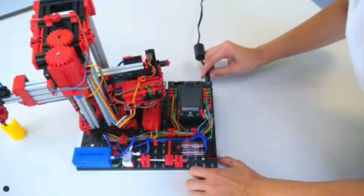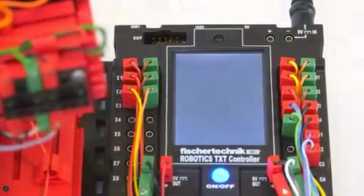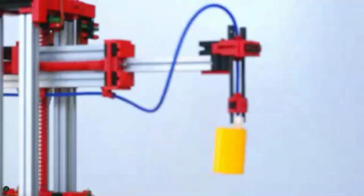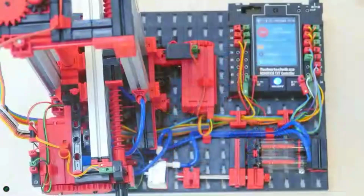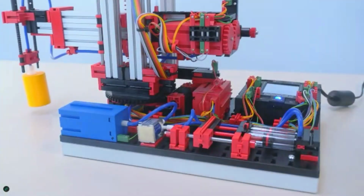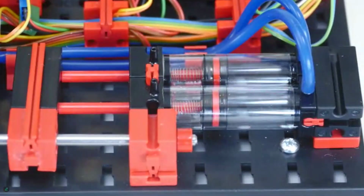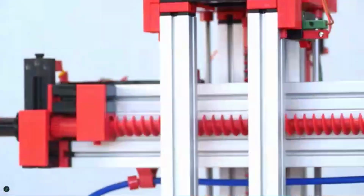The 24-volt version of this model, as well as all of the 24-volt models we are going to be looking at moving forward in the presentation, each have a relay board for motor polarity reversal and a multi-pin connector. In this case, we're going to be talking about 34 pins with a grid of 2.54 millimeters, as well as additional PCB terminals with push-in connections for all inputs and outputs. And again, this 24-volt version, as with all of the 24-volt versions that we're going to be looking at in this next section, will require you to provide the PLC and the programming.